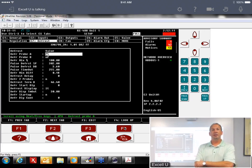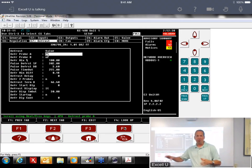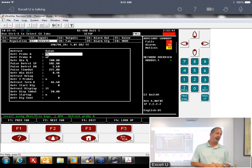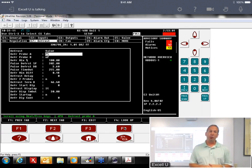Yes, sir. Did you go over diagnosing the board's bad before these guys? Yes. The board is bad, and we send them in and we say nothing wrong. So when I saw the board is bad, most of the time I couldn't get it to come online. The first time I saw a bad board, actually the thing would power up. Everything looked normal from the display, and it was in the middle of the lineup, and it was the only one that wouldn't come online. Check the address, check the baud rate, check the connections, everything. And the modules before it and after it were all online, so we knew it wasn't a broken network. We replaced the device, and it came right online. So that's one of the things I've seen for a bad device.